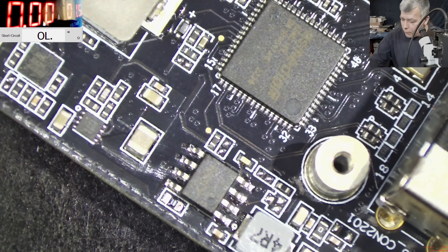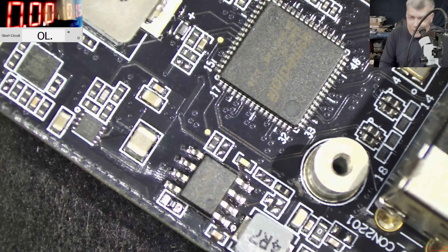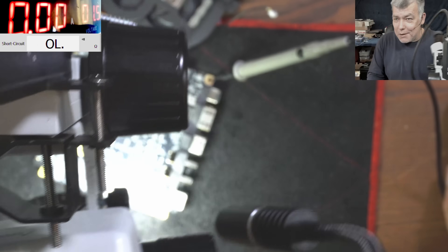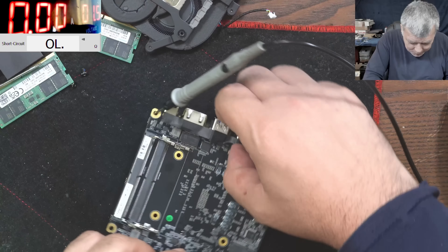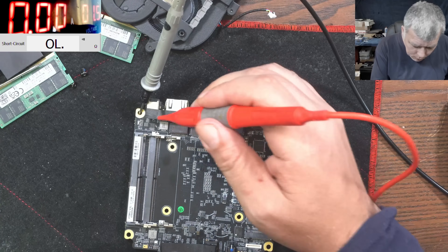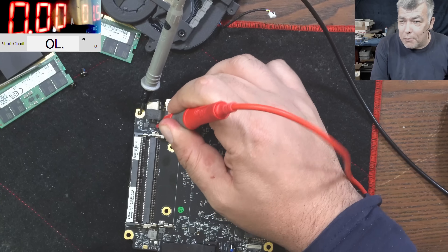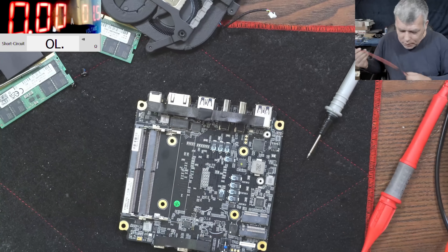The capacitor is removed. Now we are not replacing the capacitors on this video — maybe on a different video. Okay, so let's check: coming with the current on the same spot — it's not short anymore. You see, it's not short now. The second MOSFET is still shorted.